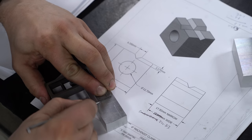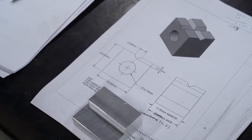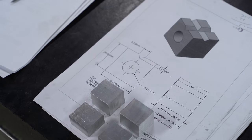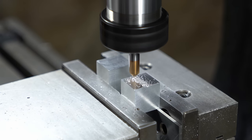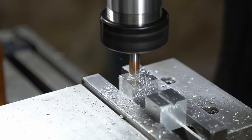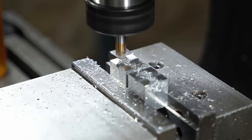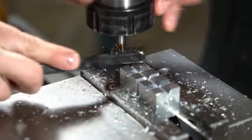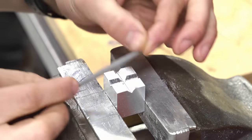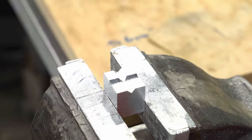Those all need cutting in half again, and as mentioned I'm in a rush, so I'm going to use a special method that's only available to liars, cheats and YouTubers. Now we're grooving the top — this chamfer mill doesn't actually cut on the very tip, so I'm basically drag engraving this. I've got the parts nice and tight in the vise — it's carbide versus aluminium, so I think the carbide will win. Cleaning off the mess that's made.